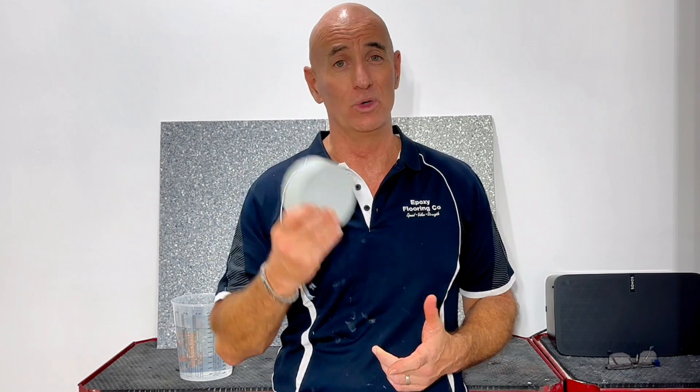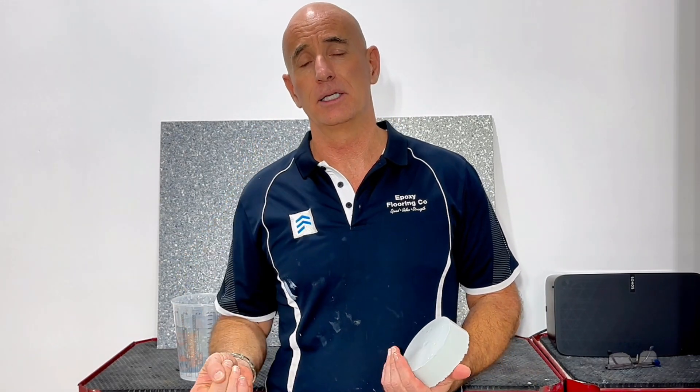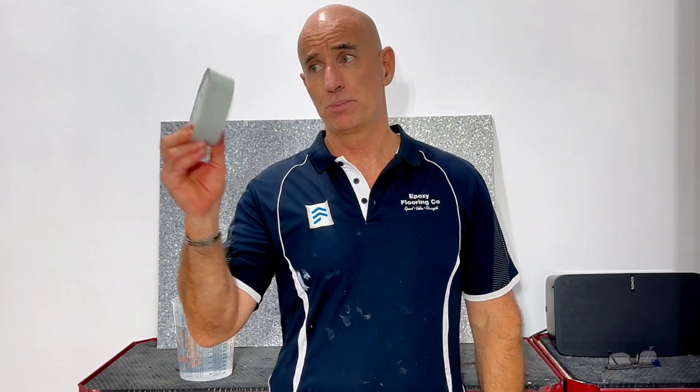Knowing just how good epoxy is as a waterproof material, it's really enticing to think you'll just put it over something and hope for the best — but really, that's all you can do with this product. If you want to sleep well at night, you really need to pay the money and get a licensed waterproofer to install a waterproof membrane suitable for your application. They are trained, government certified, and their license depends on the guarantee and success of that membrane.